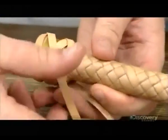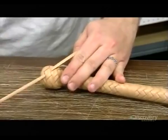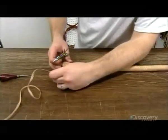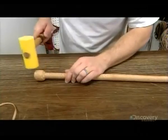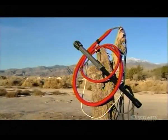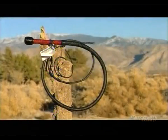They fold the yoke from the overlay over the foundation, then, with a separate strand of leather, cover the foundation with what's known as a Turk's head knot. After trimming the knot strands, they shape the knot with a soft mallet. Then, more rolling. Lastly, they apply a coat of natural shellac to the entire whip. This protects the materials and produces a nice sheen.